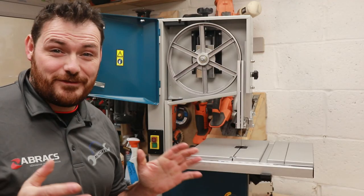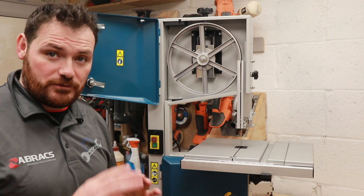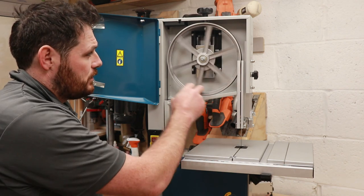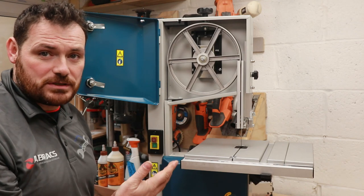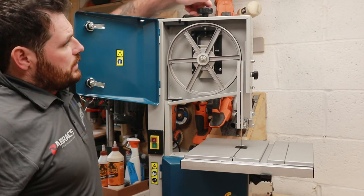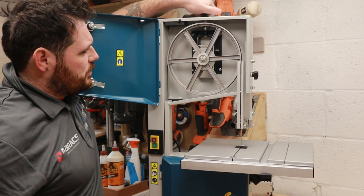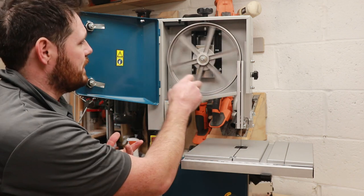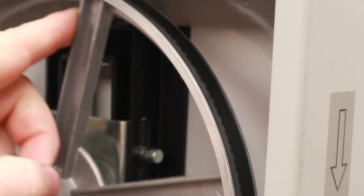So I basically use the Alex Snodgrass technique to set the tension on my bandsaw blades. If you search his name you'll find loads of videos about how to tension your bandsaw blade - he'll probably explain it way better than I will - but for the sake of this video I'm going to show you my take on his technique. I've left this blade exactly how it came out of the box, I've not put any tension into it yet whatsoever. So let's see what the blade is like before we start. If I spin the top wheel you can hear the blade rubbing on something, so it needs a bit more tension. I can apply the tension up here - I'm just going to put a bit in just to snug the blade up, and it takes that noise out.